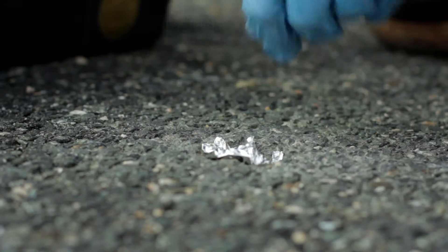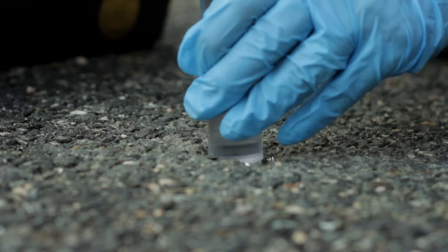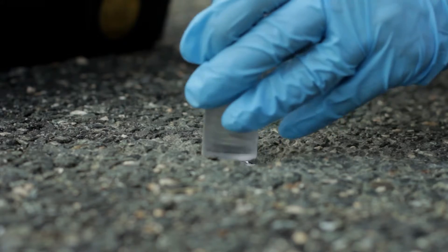Using the tapping dowel and a hammer, push down or tap the aluminum foil into the hole so it forms a seal on the metal pipe and sits 1 quarter inch below the surfacing.